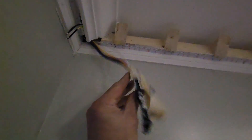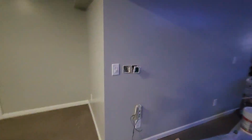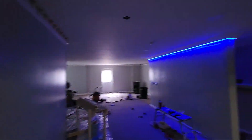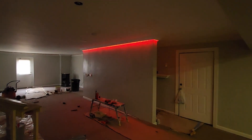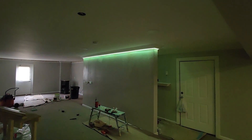Again, here you can see I've got one set of cables — this set goes to this run and they end over there, and there's another set of cables there that goes to this run. So this is in two L shapes, hence why there's going to be two switches there. I said to the customer from my experience to do one run on one switch — you'll throttle the power too much and you'll get light fade. But can you imagine when the whole thing is done? And this is what you get.